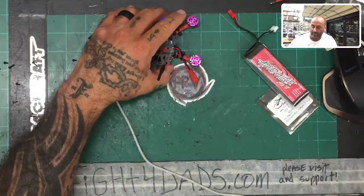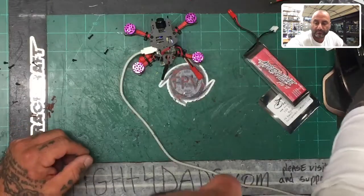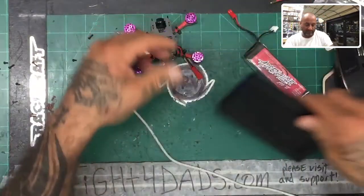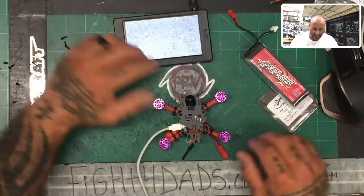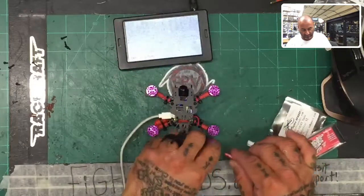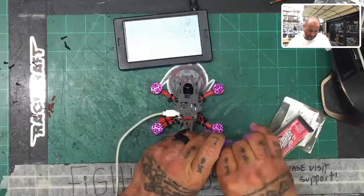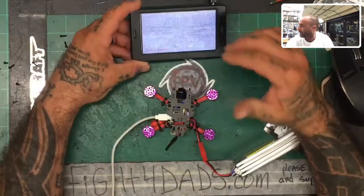Okay, let's go ahead and plug in. There we go — that's the first noise I want to hear. I'm also going to power up the VTX, which may cut our video out — I hope it doesn't but it might. My goal here is to make sure that we've got video. I'll take our monitor, which is right here. I'm gonna go ahead and turn this on so you guys should be able to see that as well. If this is working then we should be set the minute we apply power. Also trying to make sure I don't have this capacitor facing me when I plug this in — so here goes nothing.